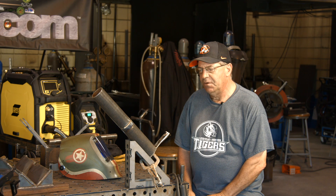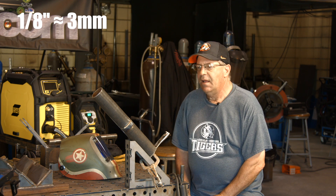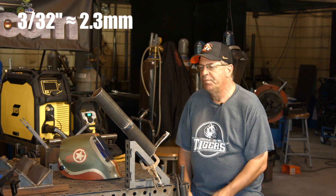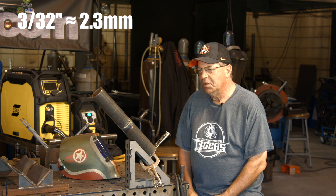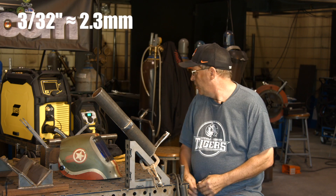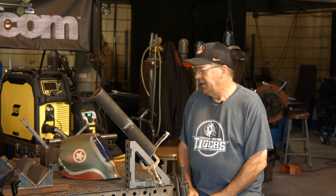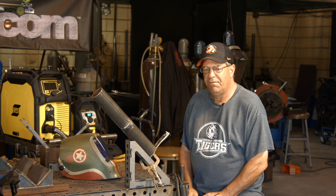I got to communicating with her and found out she's running an 1/8-inch rod, which is fine. I like to run the 3/32 simply because you get a little more control. My experience with the 3/32 6010s on a root — they're real active, they blow up, and it depends on the machine. I'm running off an Esab Renegade and I've actually turned my amperage down to 60, and I softened up the crisp setting down to 40.